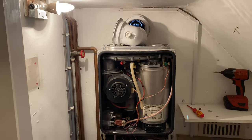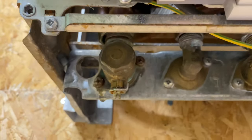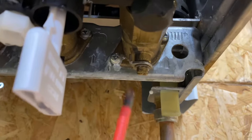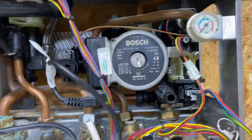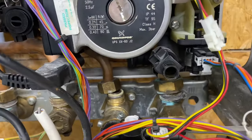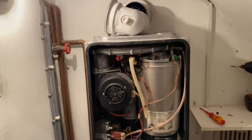Now we need to drain the boiler down: disconnect the electrics, disconnect the condensate trap, and then drain the boiler down. We've got the flow on the left hand side — turn that so it's across. All the way over to this side we'll see the return, and turn that off as well. There's a drain off here and when you open that you'll get full flow out and it'll drain down really quickly. If you've got a schrader valve tool you can also take the schrader valve out, which drains as much water off the expansion vessel as possible.